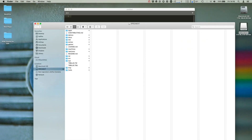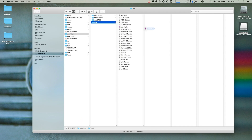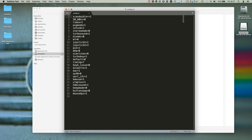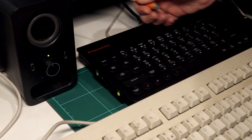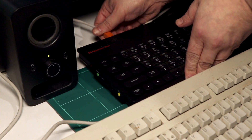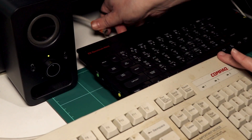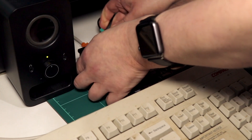Now for the process of getting these cores installed onto your Next. You'll need to make one configuration change to your Next's NextZXOS installation. Insert the card into your modern computer and open up the config.ini file located in the machines/next directory. Set the value of the PS2 line to 0 and save. This is used to tell the Next that its PS2 port will have a keyboard or a PS2 keyboard-mouse splitter connected. When set back to 1, it signifies that only a mouse is connected. For some of the cores, you'll really want to use the PS2 keyboard instead of the Next's membrane keyboard, so this is quite handy.